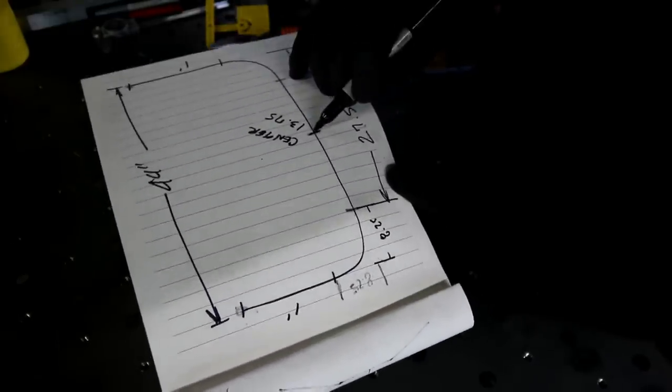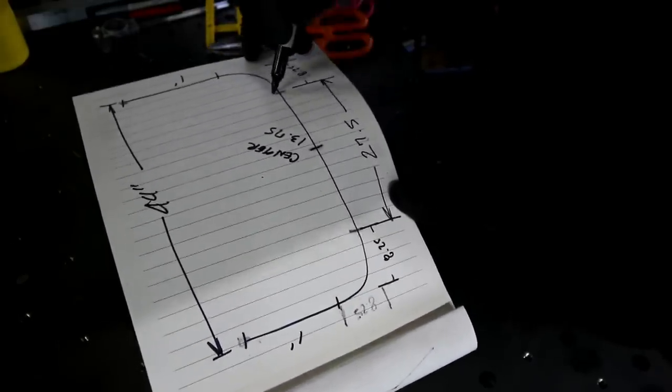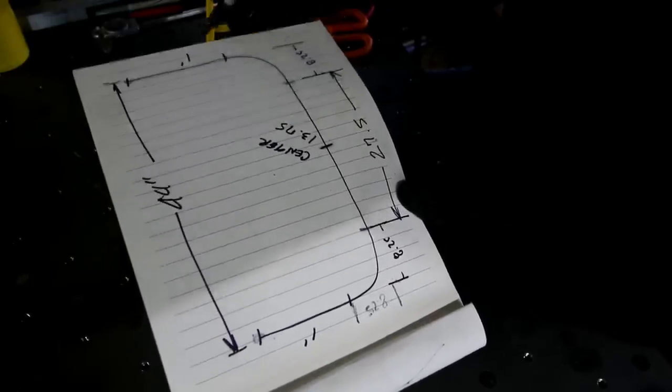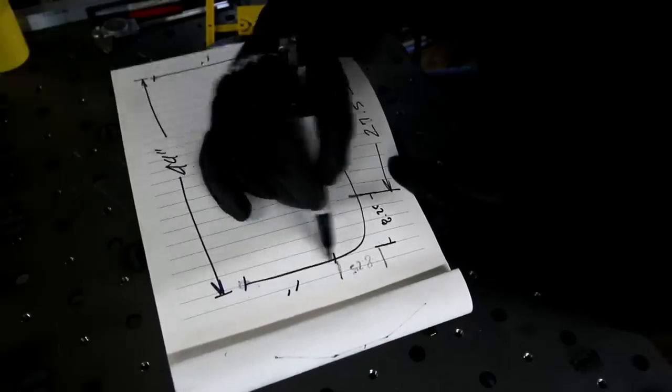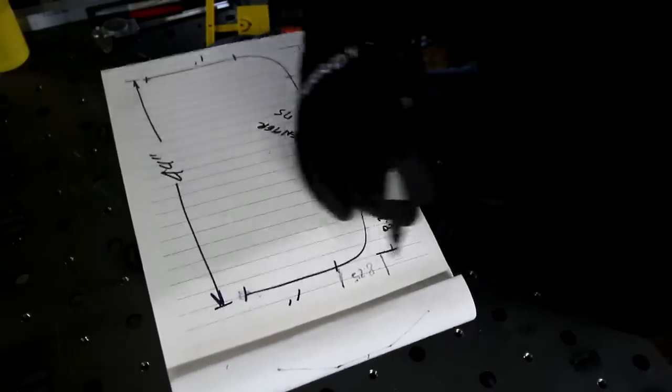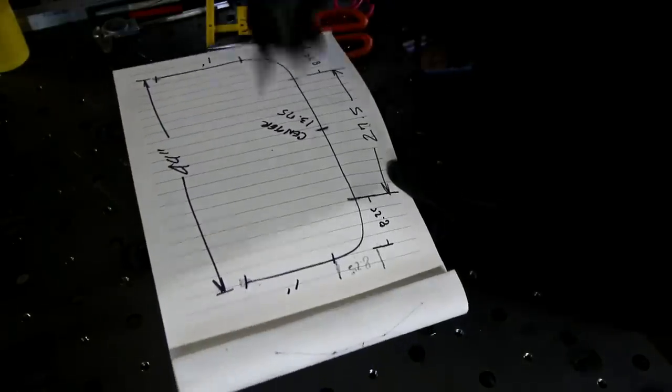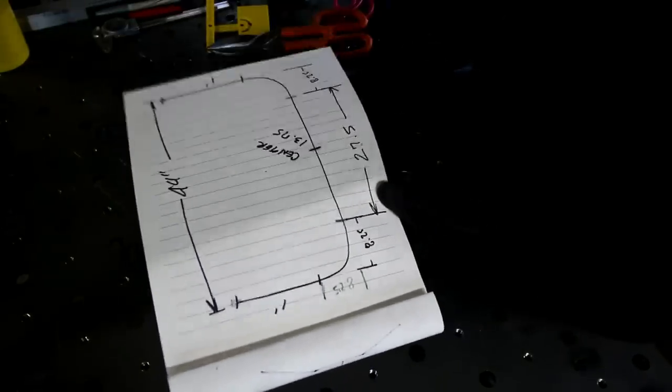I'll flip the bar around. 13 3/4, I'll start the bend right here. I'll bend that thing 90 degrees, I'll make a mark on the bar. Once that's done, I can measure off a foot, 11, 10 inches, whatever it is I need to acquire the total distance, then I'll just measure that off, and I'll hack the ends off. And there you got it, a U-shaped bend.